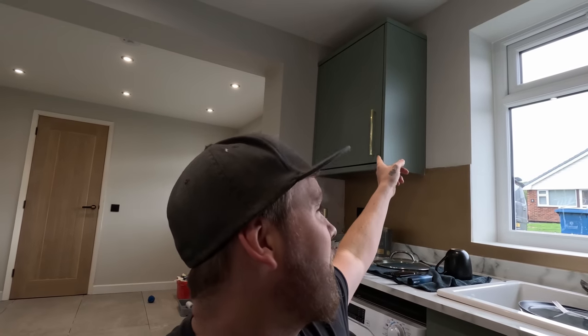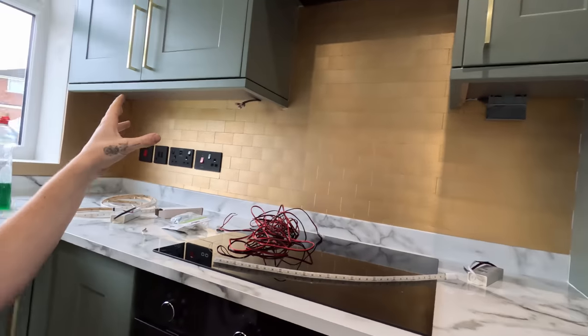Normally we just put one line in and that's plenty, but because the lights in here that we fit are so bright and the builder messed up and never ran the cable down, we've only got two under-cupboard lights. If we can make it as bright as possible in the evening - we ran it up to a separate switch - we can just come in and use the under-cupboard lights as our main lighting. So that's the plan.